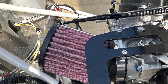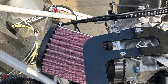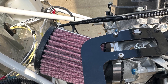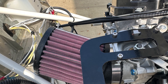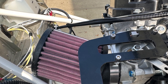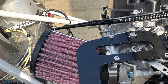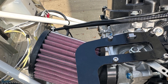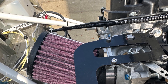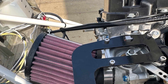The latest Viking engine installations have an offset engine mount, meaning it's built to compensate for torque and P-factor. Because of that, the right side of the engine on the back is closer to the firewall than the left side, which makes it more difficult to fit an air filter. We have several solutions for that — offset air filters where we shorten the flange just a little bit to clear, as well as foam-type filters that are also able to clear. Contact us if you have such an issue.